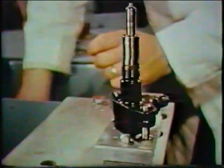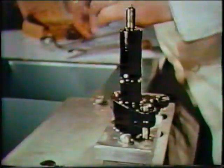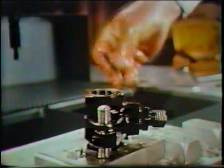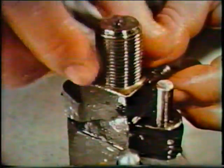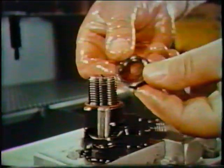When fitting the nozzle to the main body, ensure the dowel pins fit correctly in the holes provided and secure with the nozzle cap nut. But do not over-tighten — this would cause distortion and needle seizure. If too loose, a possible fuel pressure loss. After turning the unit over, replace first the spindle, then the spring, and spring cap nut, followed by the washer and lock nut.